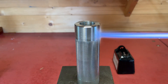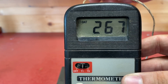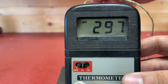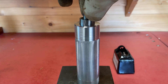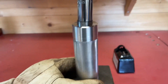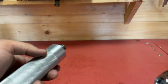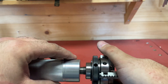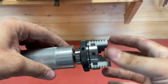If it gets stuck and then it starts heating up the steel part you want to insert, you have a problem because you're not getting it out again. So you have to be really fast when inserting the part. As you can see it didn't go in all the way, and I immediately had the hammer ready because five seconds more and it would not have fit.